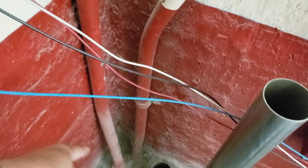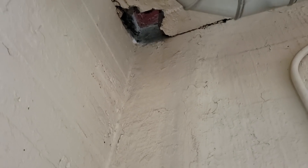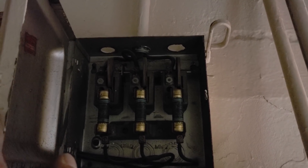When they put these pipes in, they chipped out the whole corner — this is from when the building was originally built. They put some poor concrete in there; you can see where it blew out. There was concrete on the top and bottom with newspapers stuffed in between. I'll do it up properly. And here's the elevator feed — the motor for that. It's old school and grandfathered in, right here.